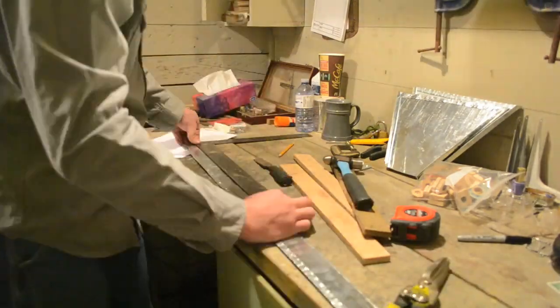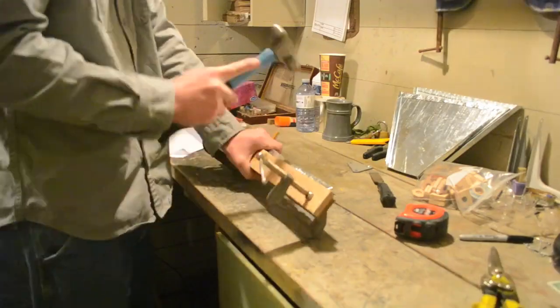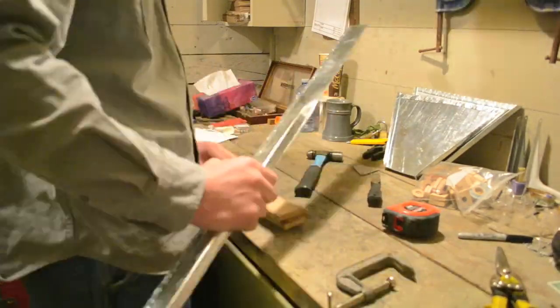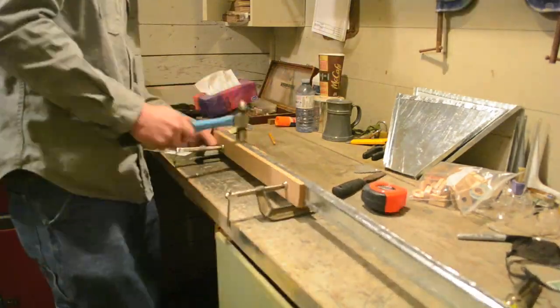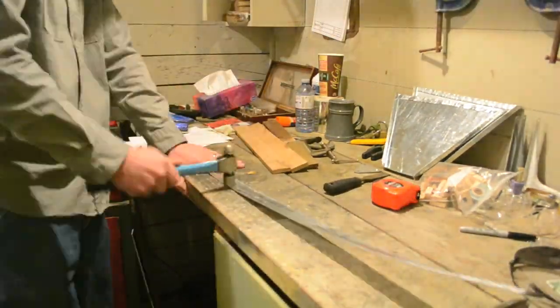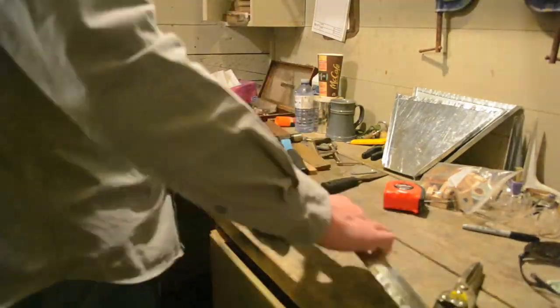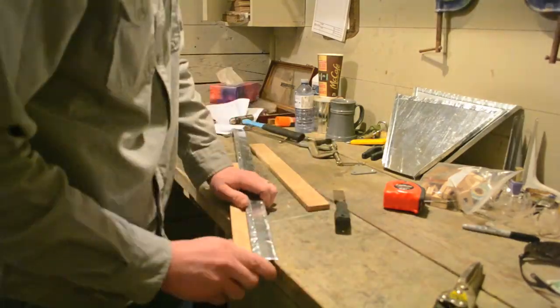Then mark out 1/2 inch on one of the edges and fold it in so it hides the first 1/4 inch fold. You now have a 1.5 inch strip of sheet metal. Scribe down the center of the metal and bend this line to 90 degrees to finish the shelf support.